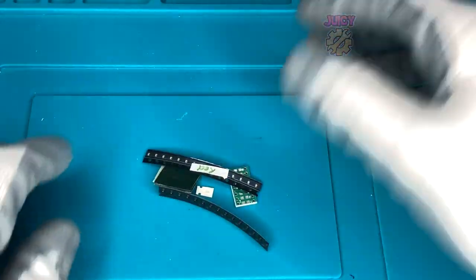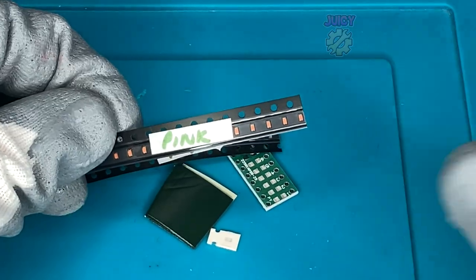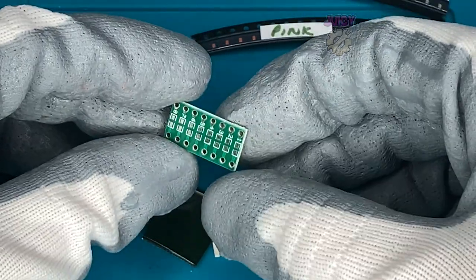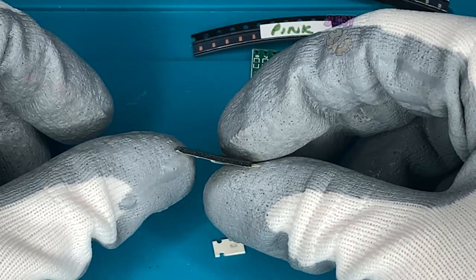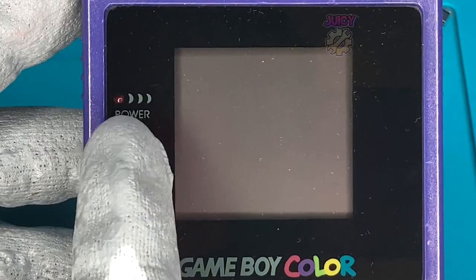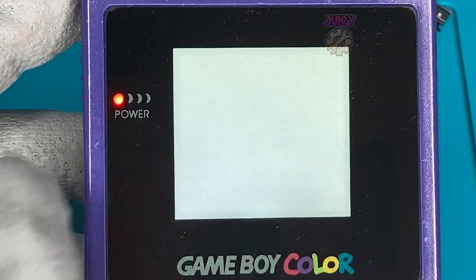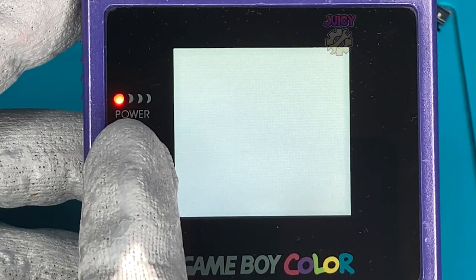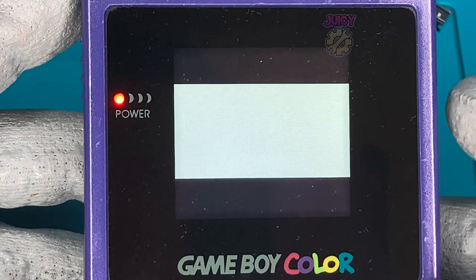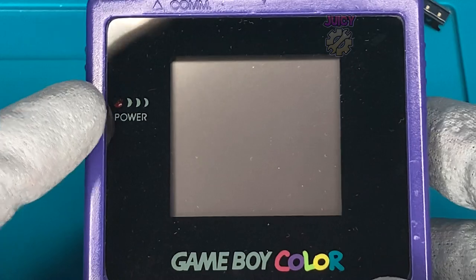These are the bits I'm going to use. I have some pink LEDs, some red LEDs, a 0603-to-0402 adapter board, a double-sided adhesive, and a 220R resistor. I'm thinking of replacing the original power LED - when you turn it on it goes red, and it doesn't really have that much use. I want to replace that with the charge indicator, but I also want to keep the original power LED just to make it look authentic.